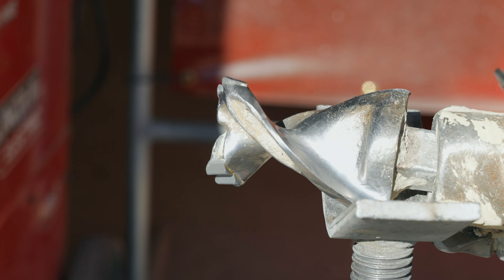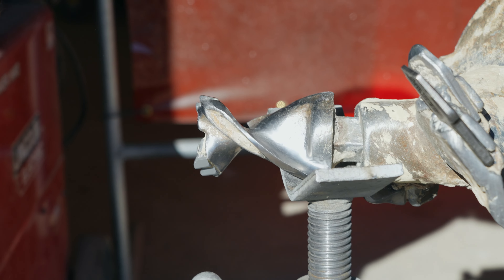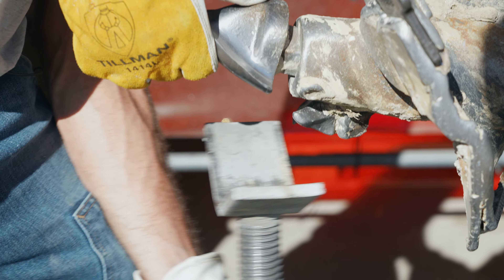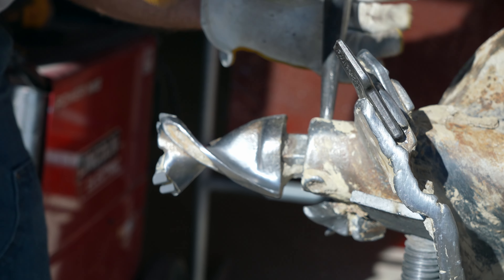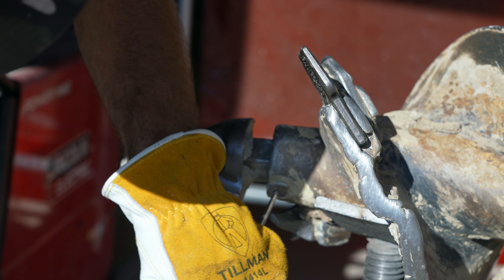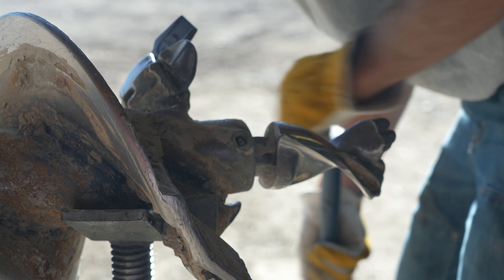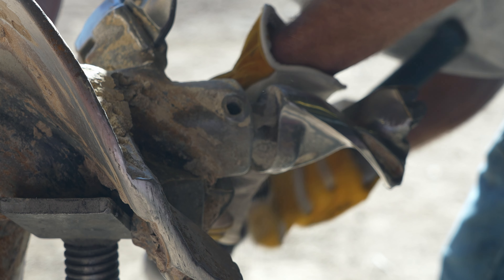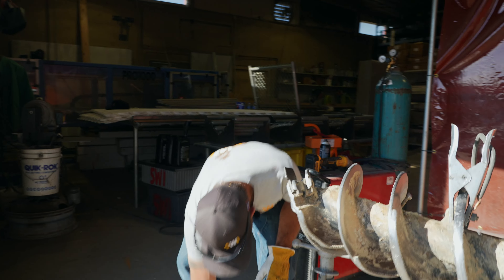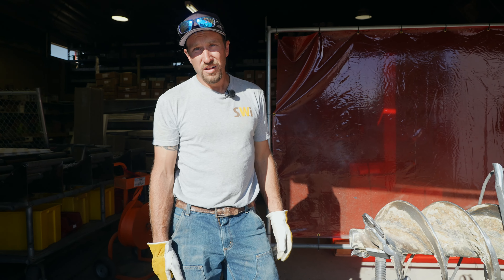All they do is screw up into the tip of the auger with a nut and a bolt. It does look like we actually need to punch our nut and bolt out and replace it with a new one. When your punch doesn't fit, you can use a crappy old screwdriver. That used to be a bolt — grade eight — a little bit of wear and tear on that. If we did not pull that out now and waited to do it later, we'd be digging our fishtail out of the bottom of a hole, which is not any fun.